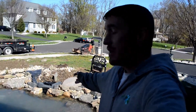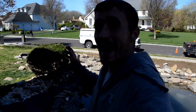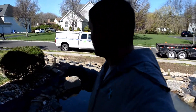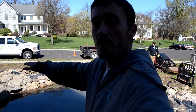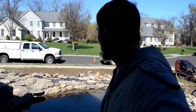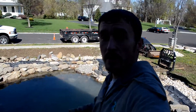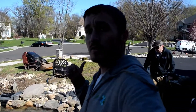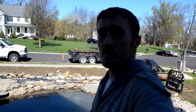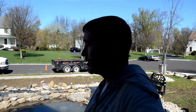Alright guys, so we are on day three of the project. We had a little bit of a setback from cutting in the skimmer box and having to mess with that. We decided we didn't have to cut in the waterfall — the edges of the dirt were about three or four inches higher than our waterfall coming in, so we figured we'd just be able to firm right up the backside. As you can see, we've got some of the water in there looking nice and clear. We spent some time rinsing and pumping it out. I'm going to start working on the edges. Al is over here with the dingo ready; he's going to clean up all the rest of the rock. We're going to dress up the top, make it all nice and neat. Hopefully this will take us just a couple more hours and we'll be able to get out of here right about lunchtime.